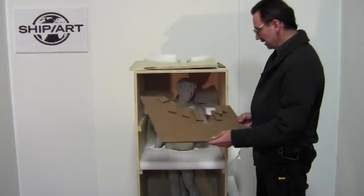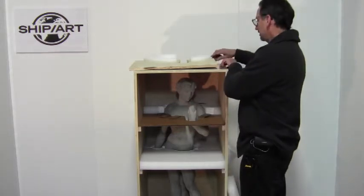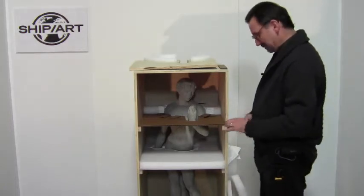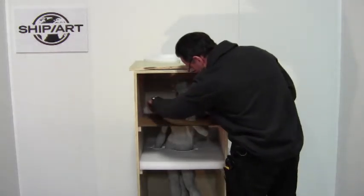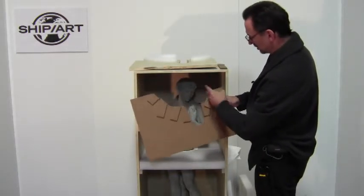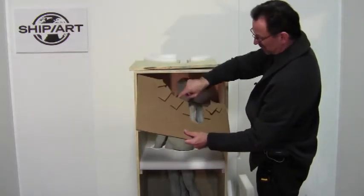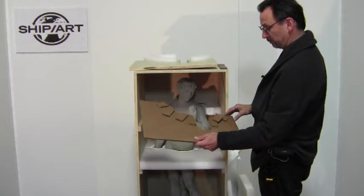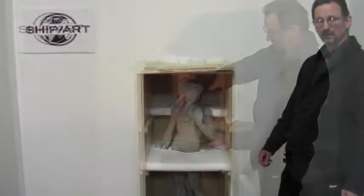Another option, though, that you have is to use a piece of cardboard, do a rough cut that gets you close, and typically you'd have a glue gun fired up when you're doing this. Take advantage of the fact you've got a glue gun, because basically you can cut a bunch of little pieces of cardboard, put a bead of glue, just stick it on there and slide it into place. If they get too close, sometimes you can even overlap for that part in the middle. Then basically that does a super accurate form of what you've got, and you just trace this onto your plywood. You can then take the foam you're going to use to cut it and subtract that.